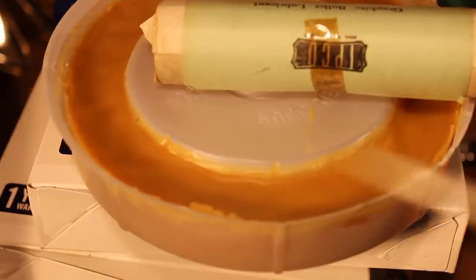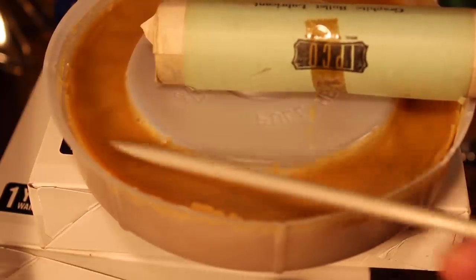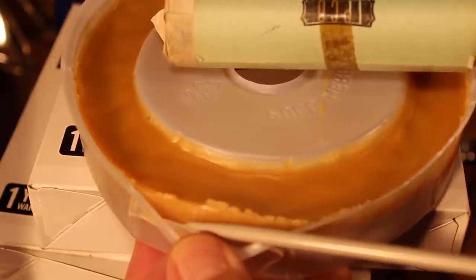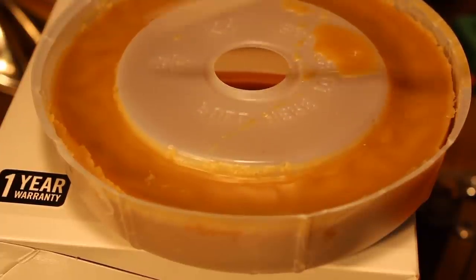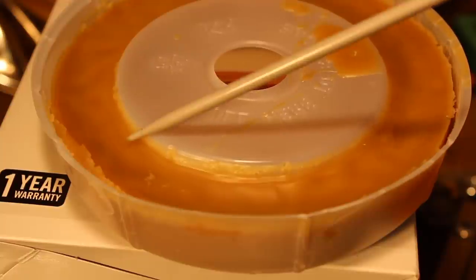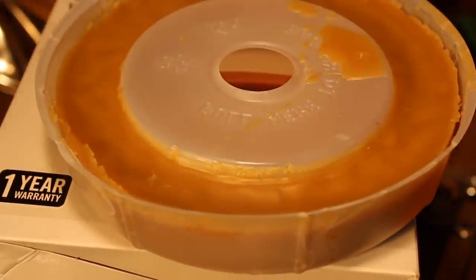I'll give you a close up of this ring. When they make this ring, they have a plastic form and they just pour the melted wax into the little mold, then sell it to you. You just peel the plastic off, take this and cut it into little squares, and pack it right into your sizer lubricator. The cool thing is, if you need your lube to be a little harder and better for hot weather, just take this and mix in one third paraffin and you'll get a harder lube. Plus, if you want a little more protection against leading, add some Lee Liquid Alox — just melt it right into this and pour it into your sizer lubricator. How easy is that?